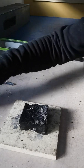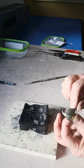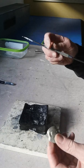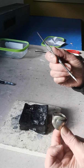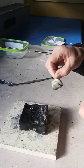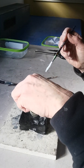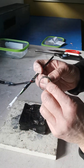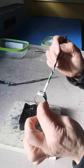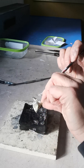When it's cool I'm going to put that into some pickle. Here is my large ring — this is still very hot and I haven't been able to achieve quite the join I would have liked, but I have got one contact point. It might relax a bit and I might get another contact point, but even one contact point would be satisfying. This is going to be a much harder piece to solder because it's much larger. You have to get the whole piece to the same temperature with this kind of soldering — silver soldering with a gas torch, oxyacetylene, etc. You can do spot soldering but I don't have that oxyacetylene equipment here.